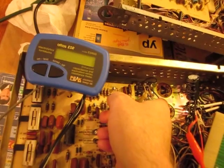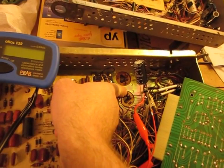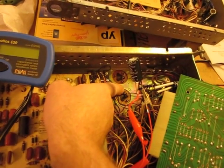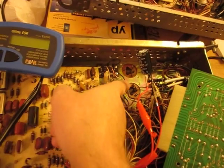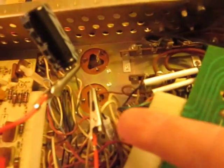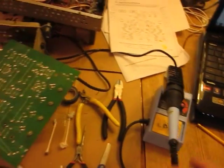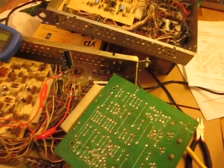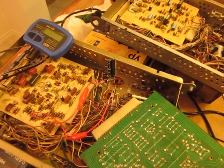So I clipped the lead, and the lead that's over on this edge here, which actually touched the chassis — that's the negative lead. I clipped one lead off of there, and now I've alligator clipped it onto my negative lead. That's the negative sign there. So now I'm going to solder that leg before I cut the other one, because there's no confusion whatsoever. So I've got my solder iron here and my solder, and I'm going to go ahead and solder this on.